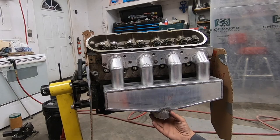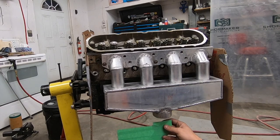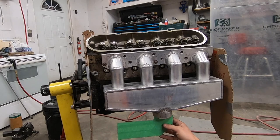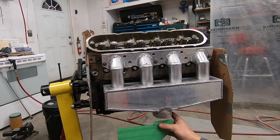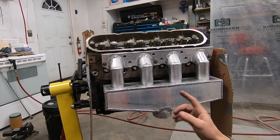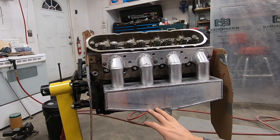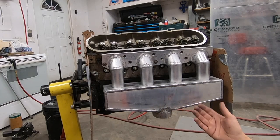The water jacket is completely welded up now and it is looking pretty. I just finished welding up around the exhaust outlet and it's all sealed up. I also made a template to show where the exhaust is going to run — there's going to be a 90-degree elbow and it's going to exit between the starter motor and the hull, so there's very little room. The water inlets to cool the exhaust are going to be here and here. There are two reasons for two inlets: one for even flow so the front and back get even cooling, and the other is that there are two low points in the exhaust so when the engine shuts off it drains all the water out and prevents corrosion.